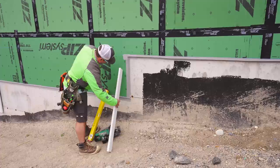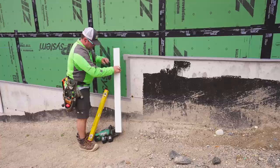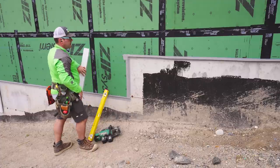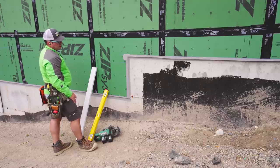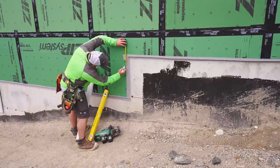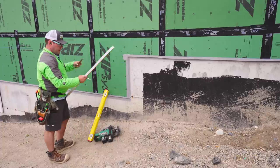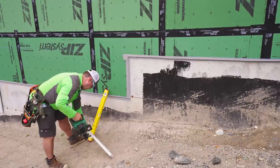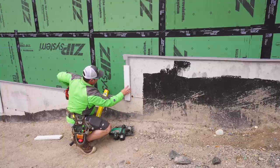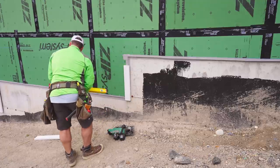Those ends need to be primed, and I like to prime the top even though it's going to get metal. Make sure that when using LP SmartSide with no sealant, you prime or paint those cut ends. Same thing here: I put a mark at seven and seven-eighths, align it with that blue line at the bottom, then mark to the top. I can let the siding run through. Seven and seven-eighths down — that piece of siding will fully cover my Fentram tape, then another three-eighths. Meanwhile, Kyle's cutting three-and-a-half inch pieces of metal, folding the tabs up three-eighths of an inch, and we're going to tape that to the zip panel.